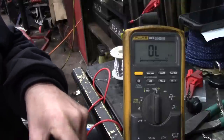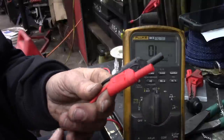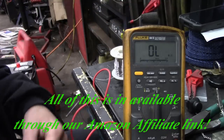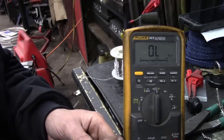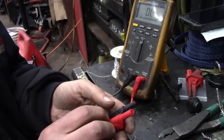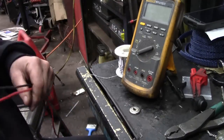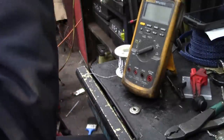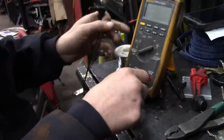In any case, these are my new leads for the Fluke. You could have your own if you go and buy yourself a set of connectors and a spool of wire. This wire here is 14 gauge; you can buy it in 18, 16, and a whole bunch of different gauges. They're available on Amazon - check the link in the description. All of this stuff is actually available on Amazon, including different connector styles, all straight types without the piggybacks. So I was just thinking this may help somebody out there save a few bucks. You can make custom lead sizes, lengths, types, whatever you want. I think it's a big advantage over store-bought or pre-built leads - you have a lot more versatility with this style.